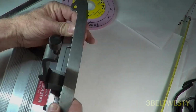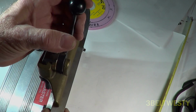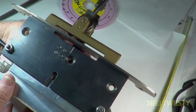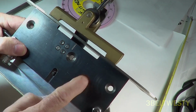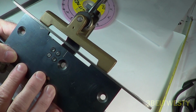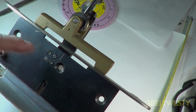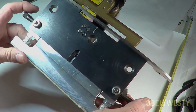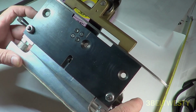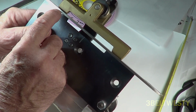You don't have to go crazy clamping these things. It can be snug, but some people tighten it so tight you'll end up busting this piece, warping it. And there's different plates on these they've made over the years. Some for figure skates. A figure skate's got a 4mm blade versus a 3 generally for hockey. And a lot of the old goalie skates were 4mm. So the Z height on this is set lower. So one of these is set up for hockey, this is right on the money. For figure skates, you have to go way lower because the center is different.